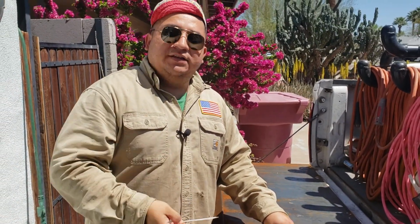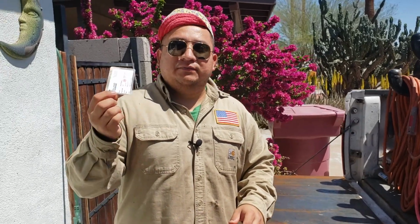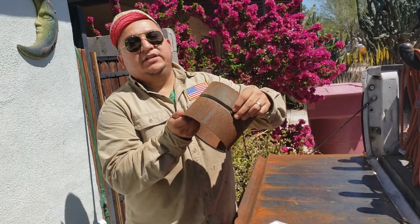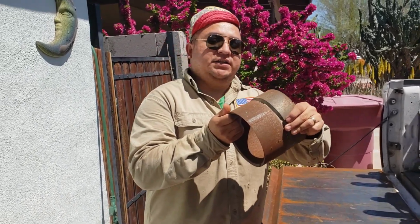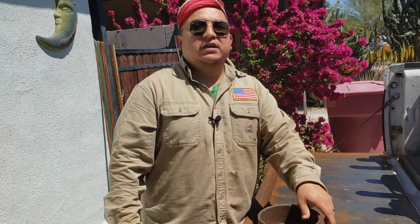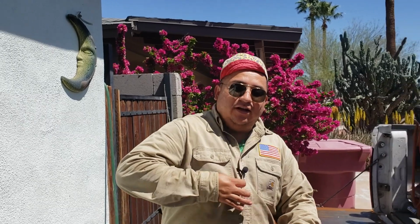So that's what we're doing today, guys: a 6G, 6-inch, 6010 root, 7018 all the way out. It's a beautiful day again here in Arizona, guys. It's like 80 degrees. I know it's gonna get hot. Are you guys ready? All right, well, without further ado, let's get started.